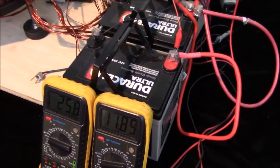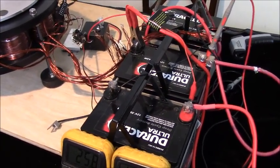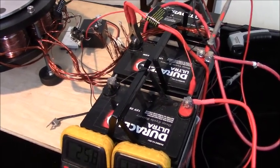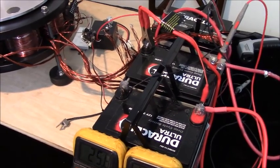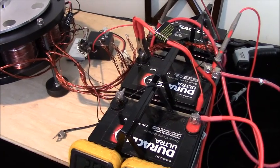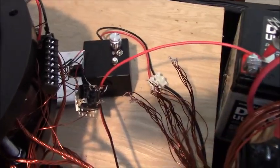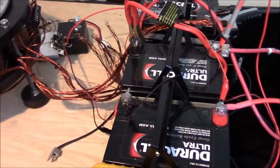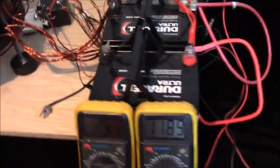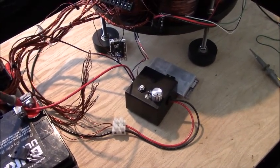So then you'll have the speed control on there as well, and that's important so that you can adjust that. Now what I won't have is the circuit breakers on there. I'll have the thermal switches so that if the MOSFET heatsink gets hot, it will switch off. But I won't put a circuit breaker in there because right now the 40 amp comes in that size, and after that when you start going up to the 100 amp circuit breakers, they're pretty pricey, and you know, if you want that, then it's going to cost more. But I figure people will have their own circuit breakers, and that really relates to how fast you want them to switch on. That's one thing that you have to consider.